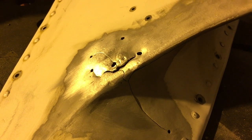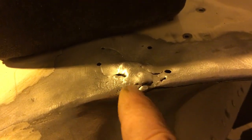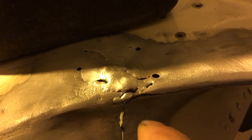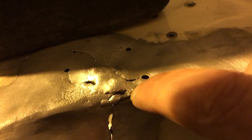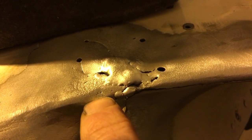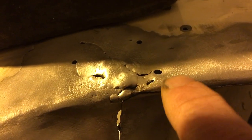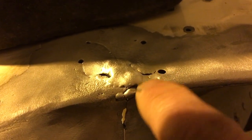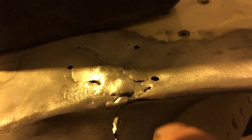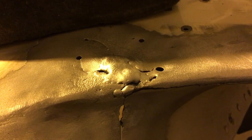Let's scrub it up and see if there's any chance of getting a few tacks on it. Well, it didn't go great but it's going to work. I've carefully tried to build a sort of bridge around these thin, porous, cracked bits here. You can see how porous the old weld was — where I've scrubbed at it, the cleaning action of the arc just pulls out plumes of porosity and it turns to nothing. But we may be in with a chance once we get these holes filled in and dressed down. Should be possible to just run along these cracks — we may be in with a chance, we may not, and I'll have to bring you back another time.